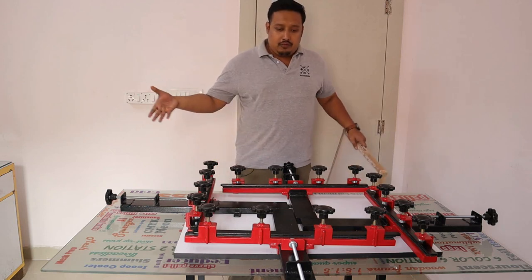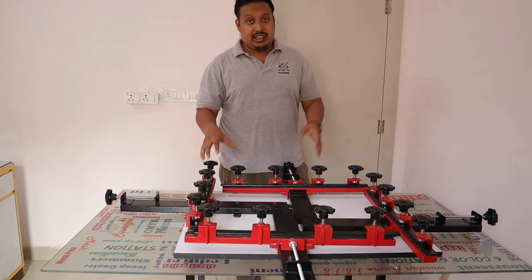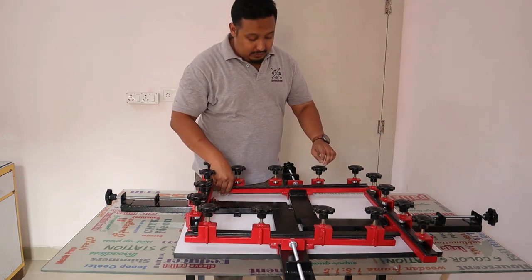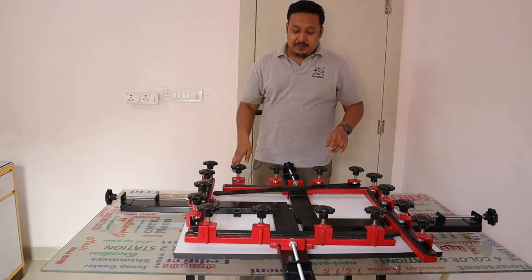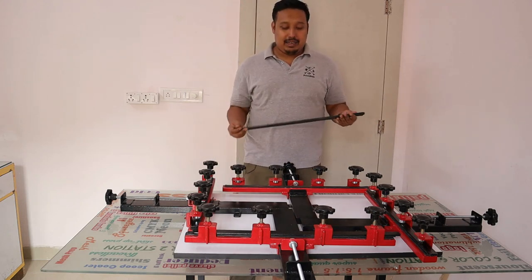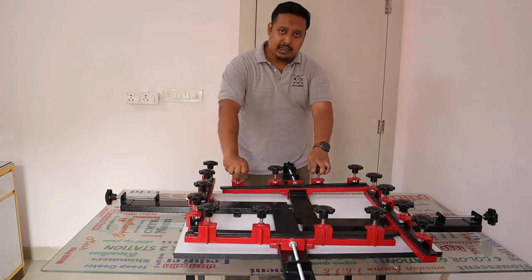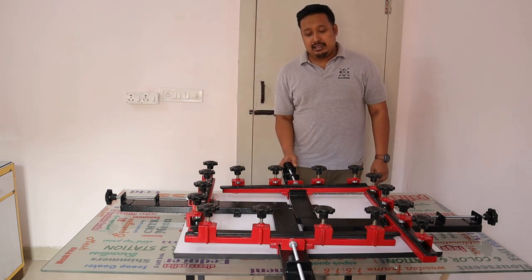In this screen stretcher you will get different knobs to hold your mesh. You get a mesh clamp — the mesh goes inside it. It consists of a long-length clamp that goes inside your mesh with a rubber grip so that your mesh won't slip. You put your mesh in, tighten it up nicely — there is a locker on every side so it won't come out.